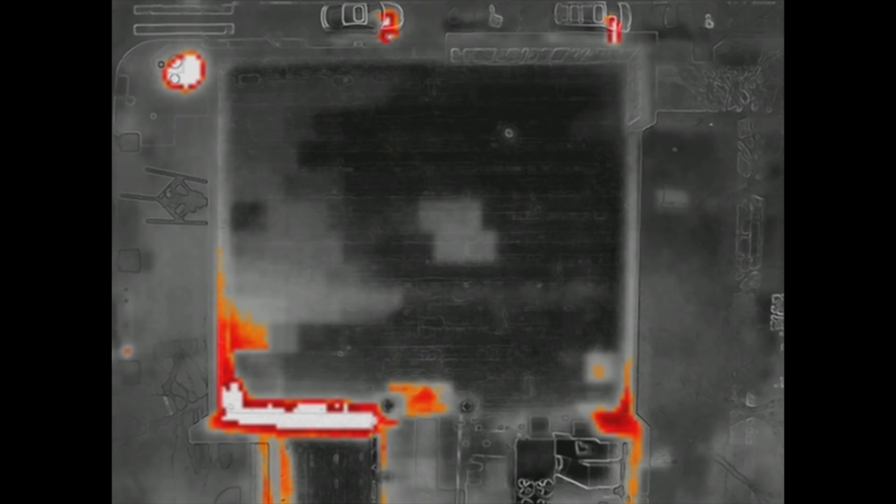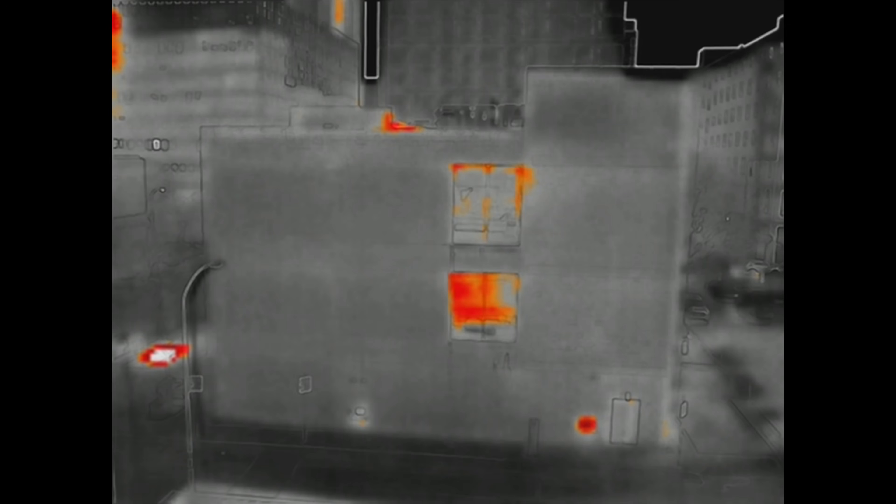This is a straight thermal photo of a whole roof, and yes, it is pretty blurry. But luckily this drone utilizes MSX by FLIR, which takes the color image and overlays it on top of the thermal image, showing the outline of objects and making the image a lot easier to interpret. With my personal workflow for roof inspections, I analyze the hotter spots of the roof and then take closer photos of the areas of interest, producing a higher resolution image of only the spots I'm concerned with. This even works when inspecting the sides of buildings for underlying moisture or heat loss from insulation problems. I could see roofing companies investing in one or two of these drones to keep in their trucks, because the size is perfect and the ease of use is greater than a Matrice.